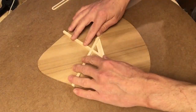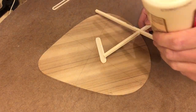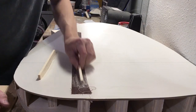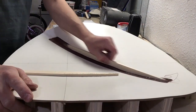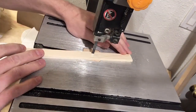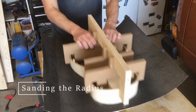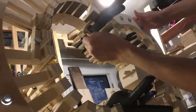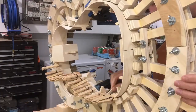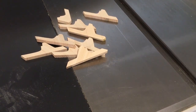Removing the braces from the soundboard — these braces were sanded to a 50-foot radius to give the soundboard just a slight dome. The back braces were sanded into a two-foot cylindrical radius, and that's what gave the back its shape. Here I'm sanding the cylindrical profile into the sides of the guitar — my adjustable guitar mold was too big for this, so I had to make a special jig. Here I am removing the kerfing, and here are a few shots of me making the side supports.